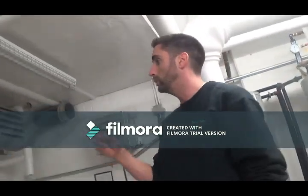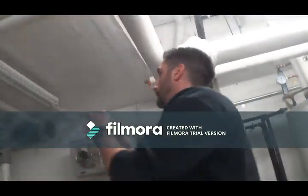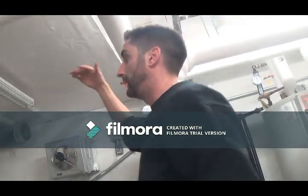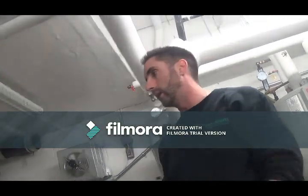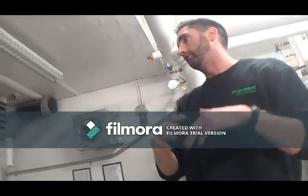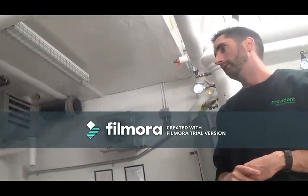Is that controlling the whole building? Just the two; there are only two underslab heating loops in this P1 area. It branches out, one goes that way and one goes this way. All they do is make sure the floor above, on the ground floor, is not too cold. So it only keeps the floor warm for anybody on the ground floor.